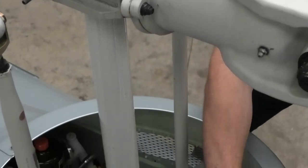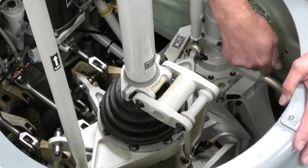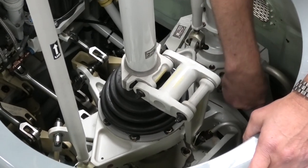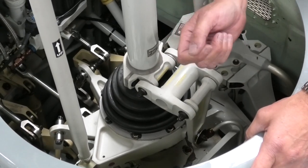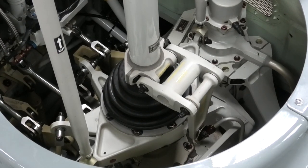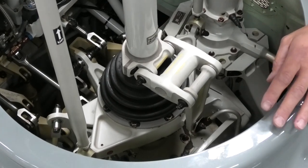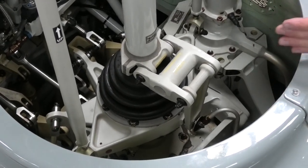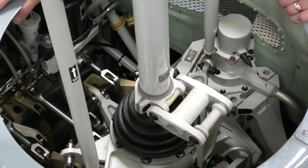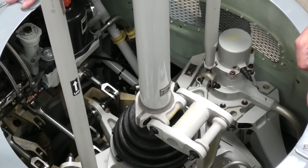Moving down to the back of the transmission area, we have the K-flex drive shaft, which is a huge improvement over the old 206 drive shaft. K-flex is a series of plates, so you want to be checking each plate for any kind of dust, fretting, or cracks, and that all the hardware is still secure with the wax lines exactly as they should be. We're also checking for any pipes that may be touching or chafing or any kind of leaks on the rear side of the transmission area, which there are none. Everything is fine and we move back down to the bottom area.